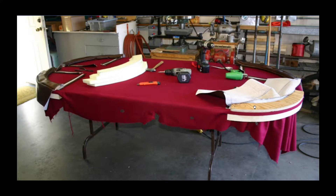When it's completely finished and you lean on it, everybody's got a nice soft edge to put their elbows on. We've got a sheet of three-quarter inch plywood, and on top of that, to round out our corners and give us a little lift, we have another piece of plywood cut to fit. Below the table we have another piece of wood doing exactly the same thing — giving us some volume and holding the felt in place — and the vinyl itself will wrap around and cover all of this.